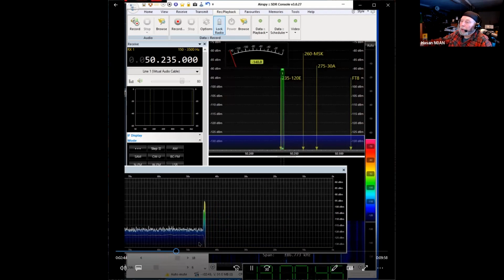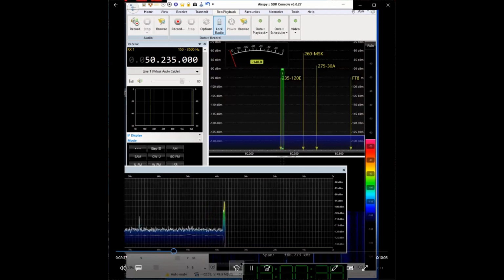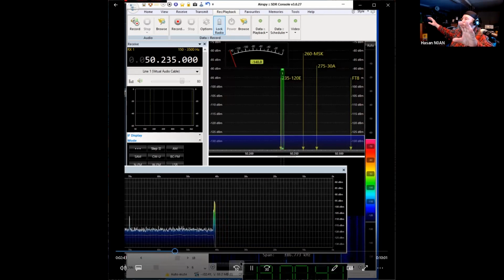Moon bounce, different matter. But purely by experiment, 120E is very, very wide. It's, you know, like that wide. 120A is like that. For some reason, it appears that the width allows the buckets to fill up with smaller signals more easily for terrestrial work. Nobody knows why. Joe doesn't even know why. All we know is that when we compared 120A to 120C to 120E, we got more decodes on 120E than we did in the other two modes. But for moon bounce, they run 120A, and I've used it and it does work. I actually made an EME contact with my 5-element array.